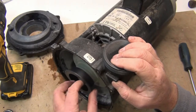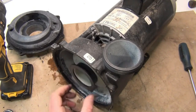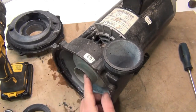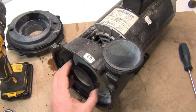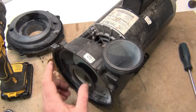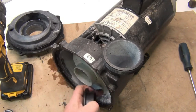This piece sits on your impeller. There's a little space — if you just took this out and put the front back on, there's a tiny space in between, so this floats in there like that. Sometimes you can hear a whistling noise from it. If these break — and they do break once in a while — you'll hear crackling and cricking because pieces are flying around.